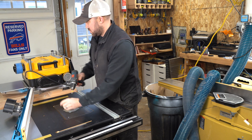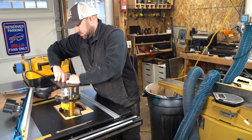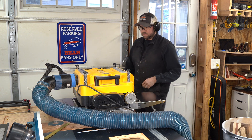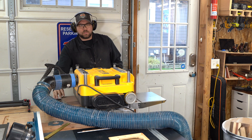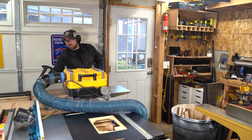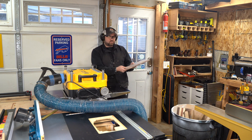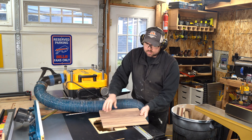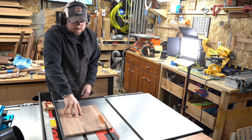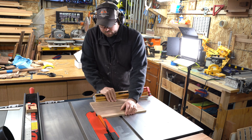To make it more fun to work with, I've got to take it all apart. One of the reasons I like this Incra lift is you can secure it pretty well with just a couple of screws — you can do more with bolts but it's plenty stable. I'm taking an old cutting board offcut and thinning it out so it'll fit in the current recess, which will give me a nice stable surface, eliminate that gap, and let the router lift fit really nicely. It'll also be aesthetically pleasing because walnut is pretty. That piece wasn't square so I'm taking it to the table saw to square it up.